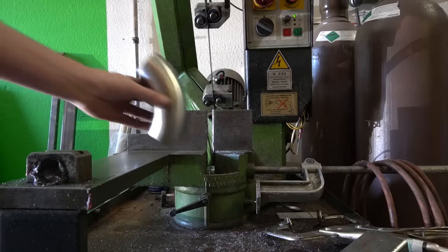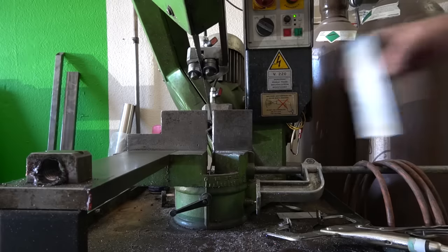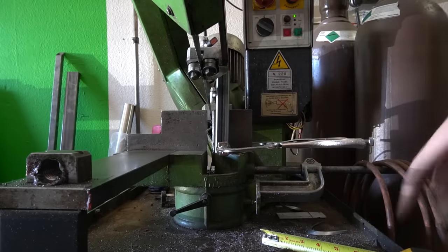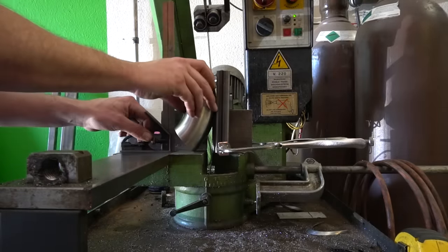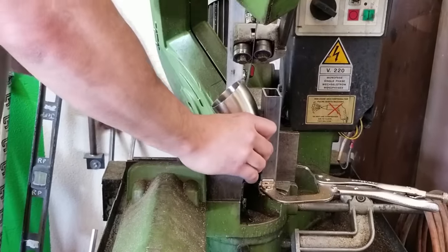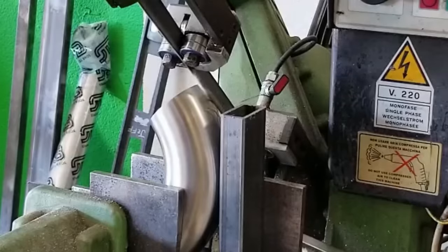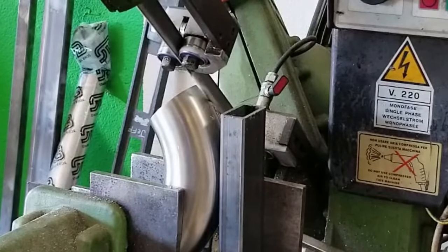Let's start with the parallel X-pipe. We basically need to slice straight down on the back side of that elbow. We need some sort of stop that dictates the amount of material we're going to remove from the back side — that's the point of the stop. It's tall and allows the elbow to rest against it. We'll clamp that down, square it so it stands vertically, and chop straight down. The typical amount of material removed from the back side of the elbow is anywhere between 25 and 33 percent — in this case, I'm removing 30 percent, about one-third of the actual diameter.